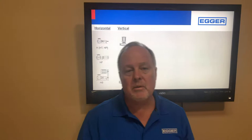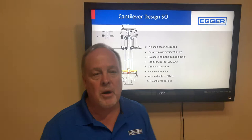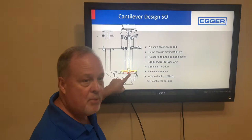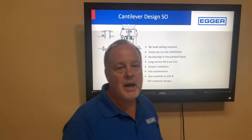We build many pump styles — horizontal, motor-mounted, V-belt drive, and vertical — but your pump is the SO vertical cantilever pump. It uses a standard-duty motor with an ABB heavy-duty bearing frame. Think of a drive shaft from an F-550 super duty turbo diesel — that's the size of shaft we have, completely unsupported from the bearing point above the liquid all the way down to the impeller, which can span five feet. That large shaft combined with the centered impeller keeps vibration low and ensures a long-lasting, smooth-running pump.